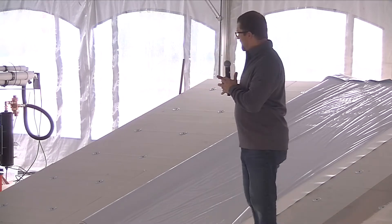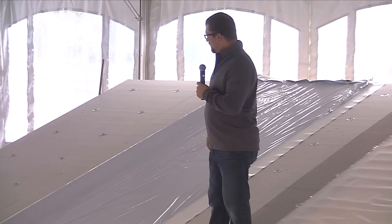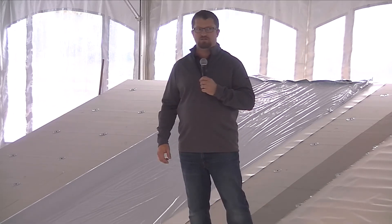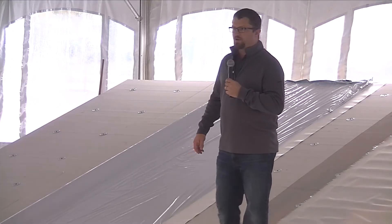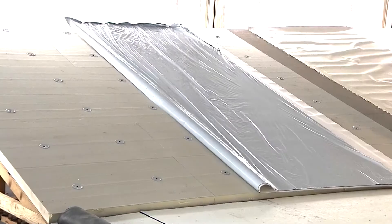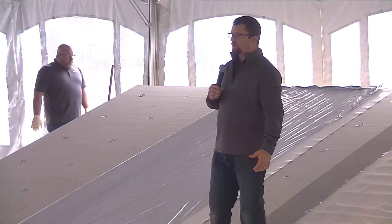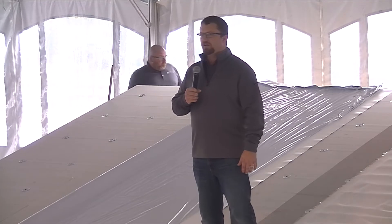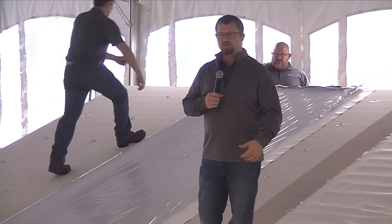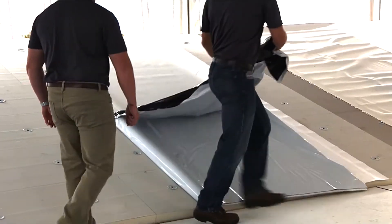Today we have it down as a standard mechanically fastened system for the insulation. With the membrane, it does all come with a release liner on the bottom that is split down the middle. We do have half of this already installed. The guys will come out and pull the release liner and slide this in. You can do barn door or you can pull out the release liner — each contractor knows how their crews work best. You can essentially set the sheet, pull the release liner, put it in, and just broom and roll this membrane in.